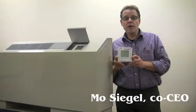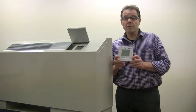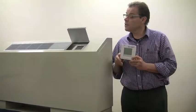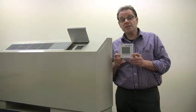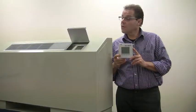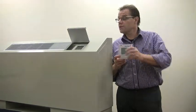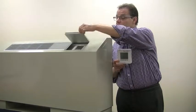This is IceAir's programmable 7-day — which can be a 5-2 or a full 7-day programmable thermostat — that is a standard feature on this IceAir slope top water source heat pump. This thermostat can actually be removed from the unit and uses a wall-mounted stat, or left in place as it comes shipped on the unit, so that it's directly accessible to a user through this brushed aluminum access door.